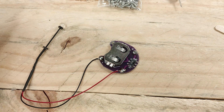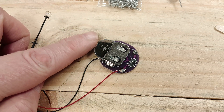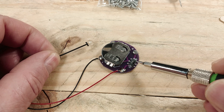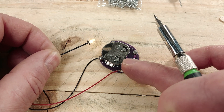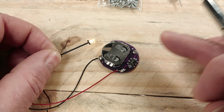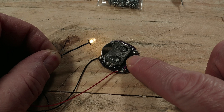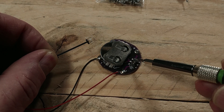Our little single white LED project is finished. Another very nice thing about this is you don't have to worry about resistors, because the internal resistance of these coin cells is reasonably high and the forward voltage matches up nicely with a single white LED. Our little lighting project is finished. Thanks very much for watching — if you enjoyed it, why not like and subscribe to our channel. We'll see you next time.